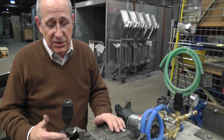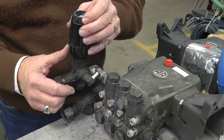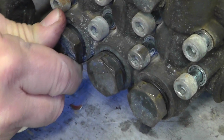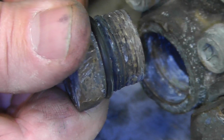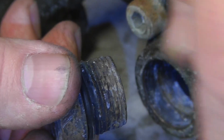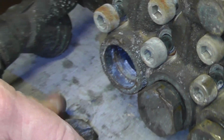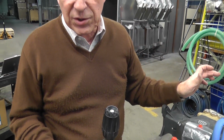This is a case here of a pump that has been overpressurized by this being adjusted to too tight of a spring tension. You can see here that the valve caps are extruded out of the head, and you can even see how they come out. The threads have actually been ripped off of the caps by the head expanding and the valve cap raking itself thread to thread and taking the crest of the threads off. This happened across the entire bottom of this pump, and this can be extremely dangerous because this could become a flying projectile. So be very careful on how you're adjusting these. They need to be done with a pressure gauge. Pressure needs to be dropped by changing to a larger nozzle.